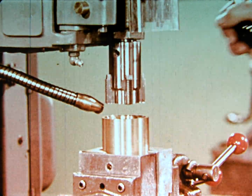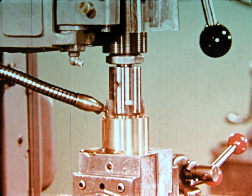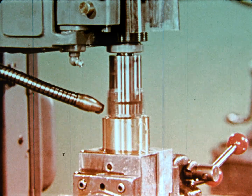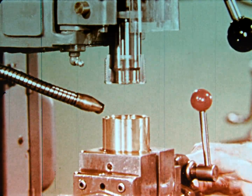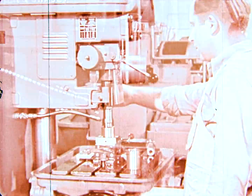This tap will do bottoming tapping if overhanging chasers and a bottoming cap are installed. For economy's sake, chasers for solid adjustable taps are interchangeable with chasers for collapsing taps. Ground thread chasers are standard for both tools.